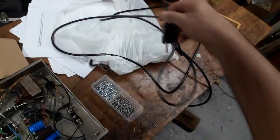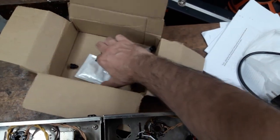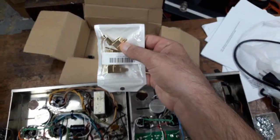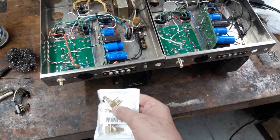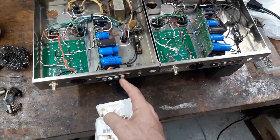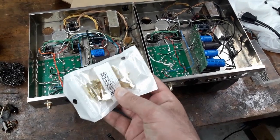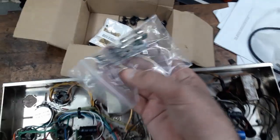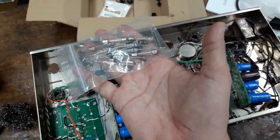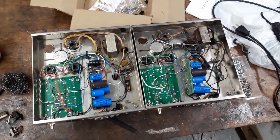Okay, so I finally got my hands on the last few bits and pieces I wanted to get. These are new, nice long, 10-foot long 3-wire cables with IEC ends that I'm going to chop off right here. And I got some strain reliefs, and I got a kind of nice modern way to do this, instead of replacing these with the big binding posts like some people do. I don't like that method. These metal posts should fit in between this terminal and a banana plug, right? So hopefully this is my preferred method rather than the binding posts. And then I have a couple of diodes, fuses, and a couple of resistors in here that I'm going to put in this last session, really. I may not finish up in one session, but it's definitely last or second to last.